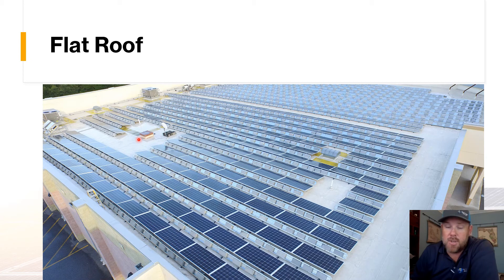We've done some very large commercial systems all the way down to small 30 to 40 kilowatt systems. Commercial solar is probably as custom as it gets, because you're dealing with different issues such as multiple meters, three-phase electricity, and demand billing. In Florida, whether it's Duke Energy, Florida Power & Light, or Gulf Power, you can encounter demand billing where machines kicking on at 5 AM set the demand bar high for the entire day. Solar combined with battery backup can offset that by storing energy generated the previous day and keeping demand at a more realistic rate throughout the day.